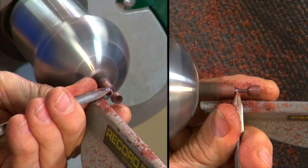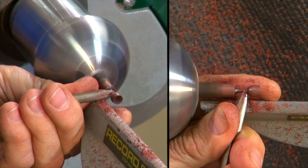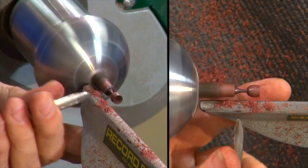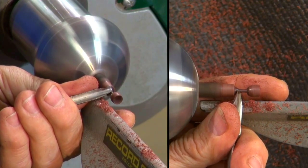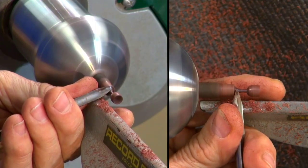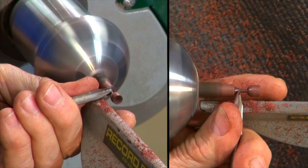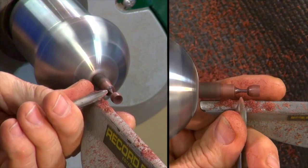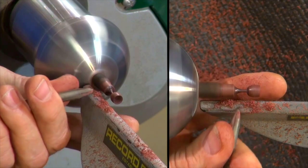A little bit thinner. One last cut. You see, I'm never afraid to take an air swing where you go to cut and you miss. You don't pick up anything. You're better off doing that than taking a cut that's too deep. Actually, I never take a last cut. Something about the word last that makes the tool start to shake in your hand. You're better off just taking penultimate cuts.